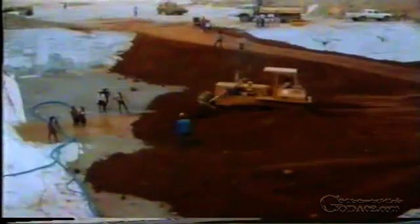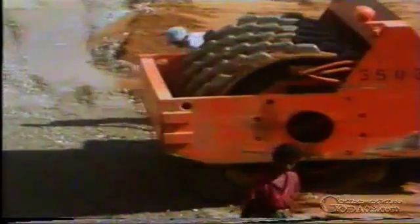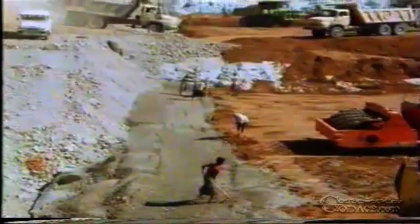The cohesive sandy soil for the inner core was dug from a side valley of the Mahaweli, about three kilometers away from the dam, and could be used in the dam almost without any further treatment. The filter layers separating both sides of the inner core from the rock fill were produced in the side crushing and screening plant, like the aggregates for the concrete.